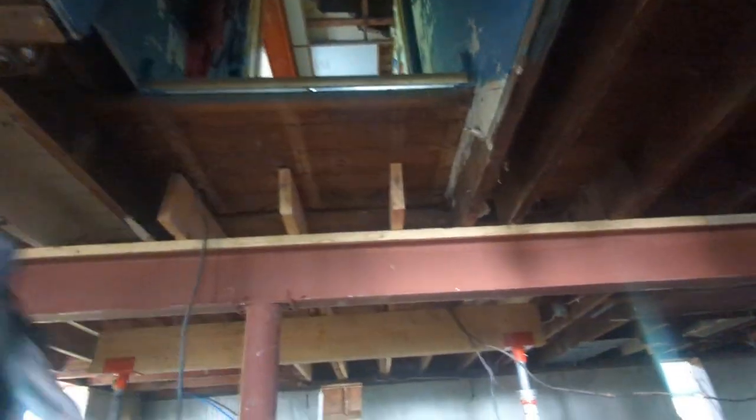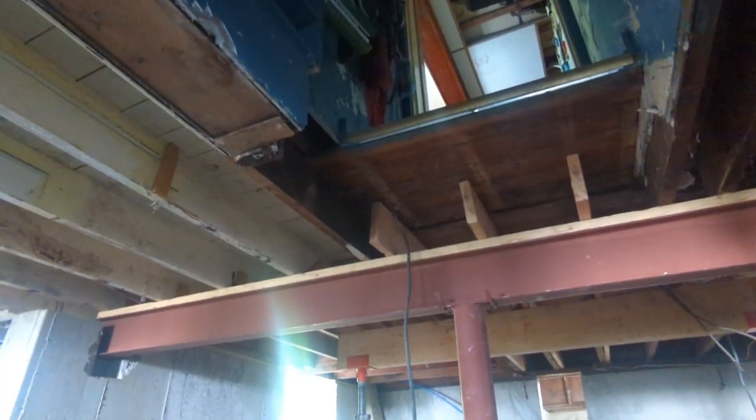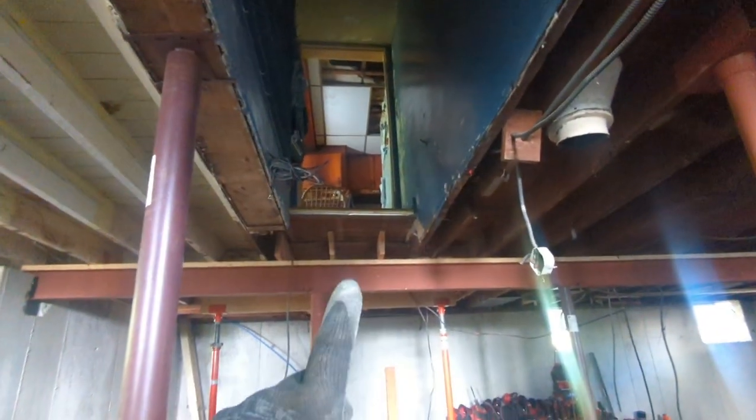Now, when you have a stairwell in a building, or in a structure like I'm used to working on, at least residential stick-built construction, it's load-bearing, so a lot of times it comes right on down to the foundation on both sides. It's a big column that's walled all the way up and up and up. But in the case of this house, we get down here into the old basement, used to have columns, but the new one, it's just a big hole in the floor system, the first floor system.